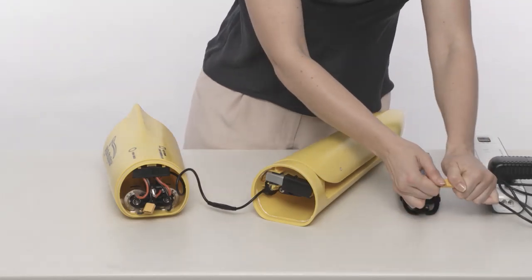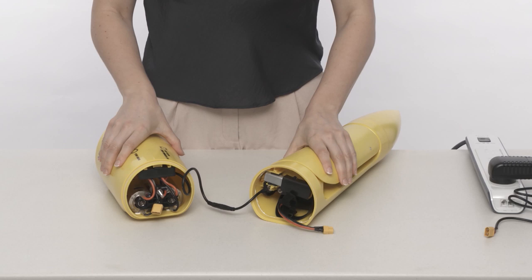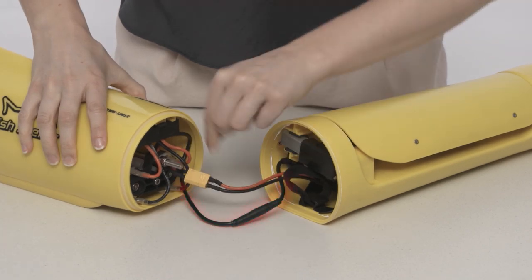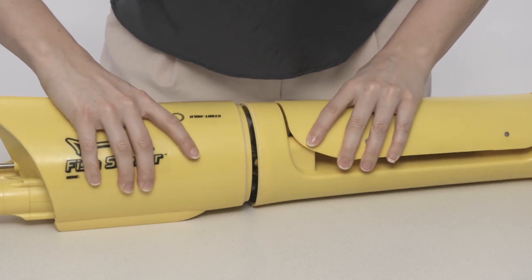You can now put the battery back into your Fish Seeker. Insert the battery into the front section of the hull by pushing the battery into the open cavity until secured past the lip to stop movement when the Fish Seeker is in use. Please note that connecting the battery will turn the Fish Seeker on, so do not connect the battery if you are not using your Fish Seeker. You will notice that there are two connections between the front and the back of the hull — one connects the compass in the nose cone and the other connects the battery. There should be no reason to ever disconnect the compass besides annual maintenance. Always make sure that the compass is connected before connecting the battery. Never unplug the compass while the battery is connected. Tuck the excess wiring into the unit — tuck the compass wiring up into the side of the rear section and the battery wiring into the front section above the battery.